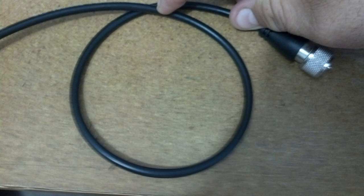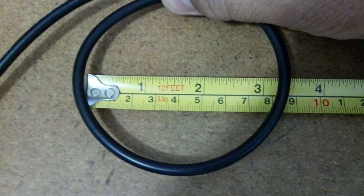You can determine the maximum you can bend the cable without stressing the coax or the inner filament — you don't want the insulation to break down. You can make it into a circle, and as long as the circle doesn't deform, that's as much as you can do. Here in the next picture I'm starting to stress it and it's becoming more like a teardrop shape, so we don't want to go that far. The coax will get hot and the foam core will move and touch the center braid, giving you a short.